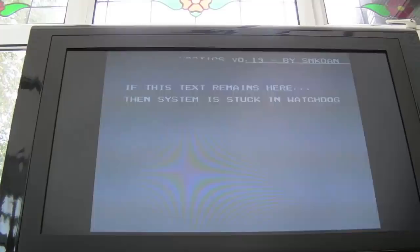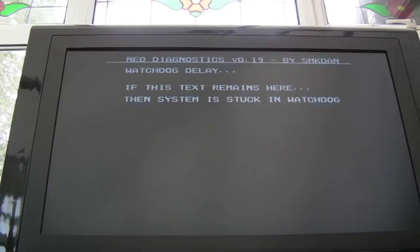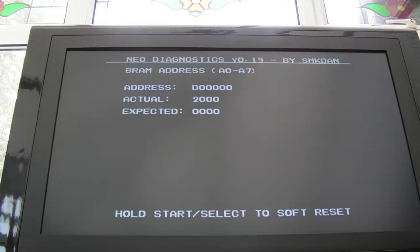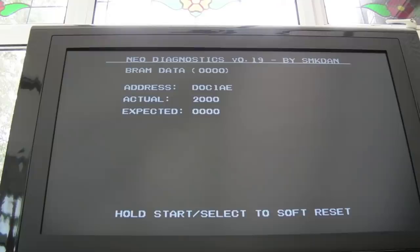These Neo-Buf chips, they're just in a terrible state. I've put like three or four in that position already on the Z80 spot. But then you see that? I can't even turn it down. Yeah, it's the same thing. It's the Neo-Buf that's causing this. And then in a minute we'll start getting Z80 errors. There's nothing wrong with the backup RAM. What's happening is the Z80 Neo-Buf is outputting on the data bus when it shouldn't be. That's what's happening, and it's interfering with other things, I think.